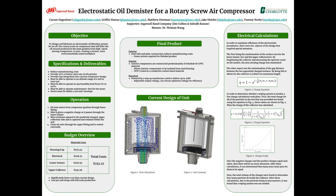The idea of a wiping system was first brainstormed to clear the oil from the collector plate. However, before that was implemented, certain calculations were completed to ensure that it was necessary. Prior to the start of senior design, Ingersoll Rand conducted a test to determine how many particles passed through the current unit and how large the particles were. This data was provided to us and was used to calculate the total charge after it passes through the negative mesh of the design.